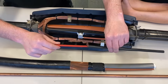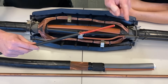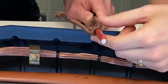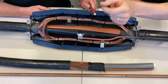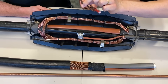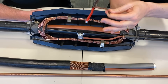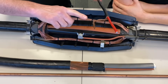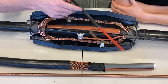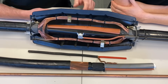We've got concentric cable here — the old fashioned red and brown. Inside, you can see the silvery colour — that's aluminium. The conductor wrapped around the outside, which people often mistake for steel wire armoured cable, is actually copper wrapped around the outside. That is your line conductor coming into your single phase property, and this is your combined neutral and earth conductor. This is the kind of cable you'll find on a TNCS system, where the neutral and earth are combined up to the origin of the property and separated from there on.